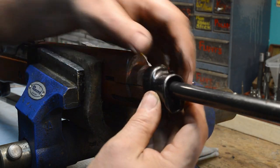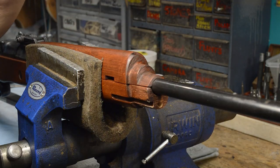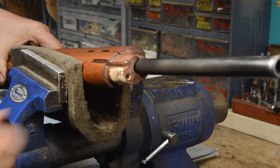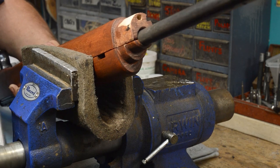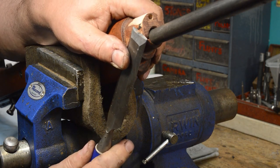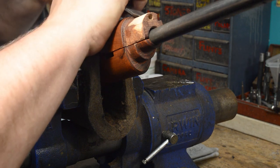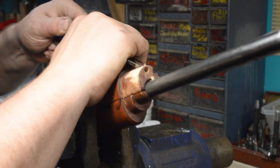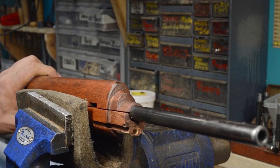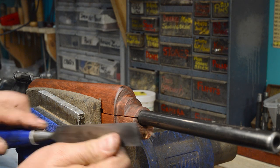Rotate that over and slide it up on there. There's a big black mark right here, and there are a couple of black marks up underneath the bottom. You can see the black right there — and the black is everywhere it's touching. So we'll leave this upside down. Why am I doing this with the action in the stock? That's when it's got to be tight. So we'll use incredibly sharp chisels and just peel off all of the black stuff, then pop off that line.